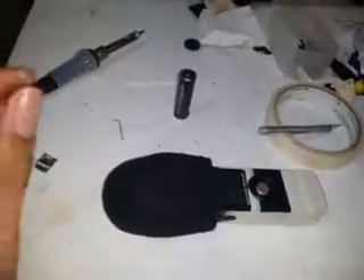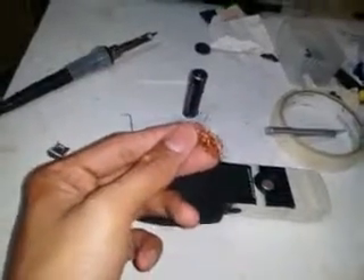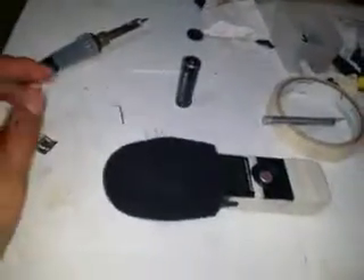So I searched for the shorted connection and lo and behold, I got one. Once I got it, I placed this magnet wire onto that larger PCB trace or pad and connected the other end of the wire to the SD card. What happened is that the SD card was detected — so it's good, it now works.